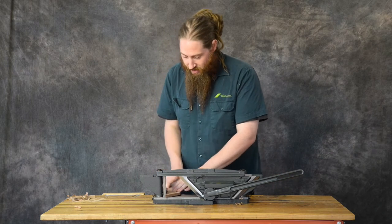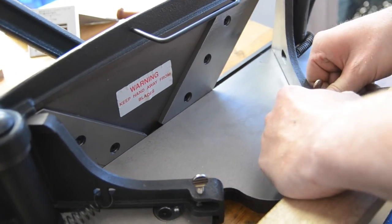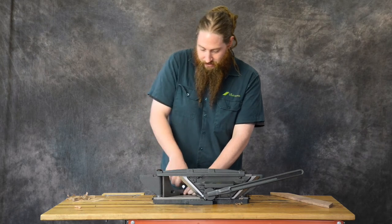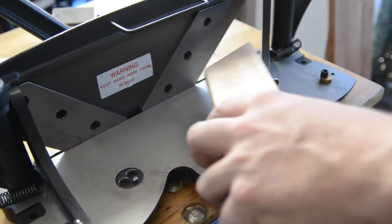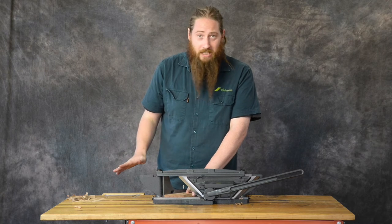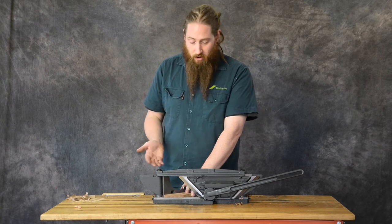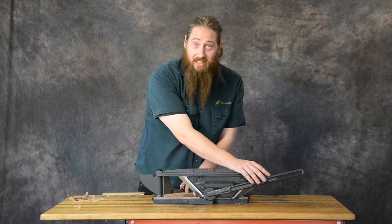With just a quick pass of this across — undo that — it'll lock over a little button like this, and then you just tighten that off and you're good for doing miters. To actually cut a miter, you just pop it in like this. You only want to take off around one — absolute maximum two mil. The less you take off the better; the more accurate your cut will be. And you'll see as I cut through this just how well it actually cuts.